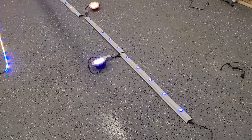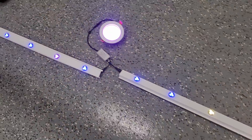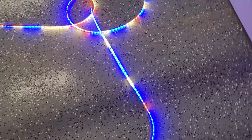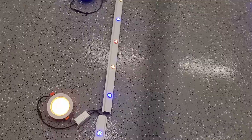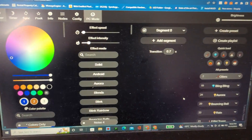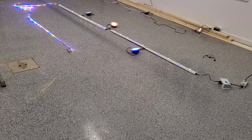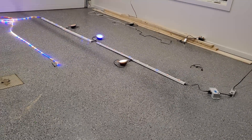Now that we have the lights hooked up, we have track, a pot light in between every set of track — three pot lights, a couple pieces of track, and then we got the rope light at the end. So now we're going to see if we can segment out the pot lights. What we want to do is make it so that we can have a setting to control only the tracks, only the pot lights, or everything together, or just the string lights on the end. So we're going to create a segment and segment out those pot lights.